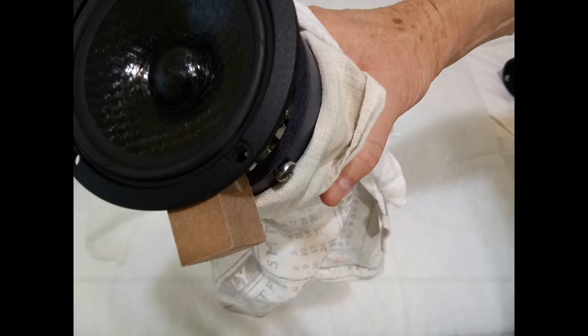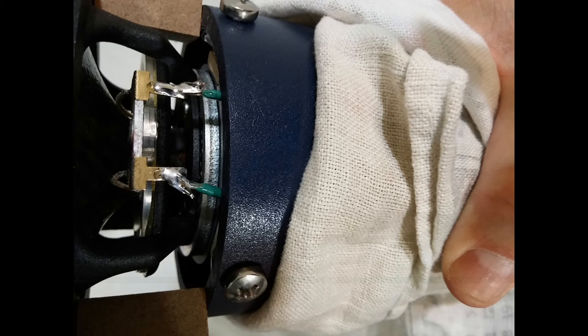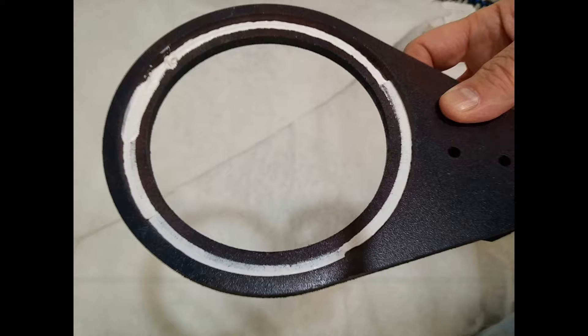I'm being really careful about the paint here — also being careful not to scratch things up. I got a little bit careless later on and ended up having to do a few little paint repair spots; we'll talk about that later. These are M4 screws, one half-inch long, Phillips head — so that a socket going over a hex head won't reach down and scratch the paint when you're tightening it down.